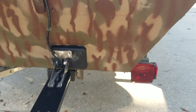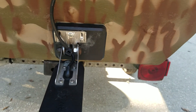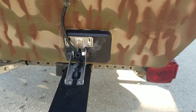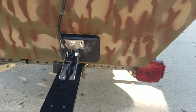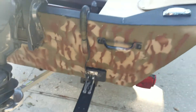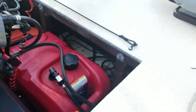Transducer on a transducer mount, so you don't have to drill a hole. That's a piece of marine grade PVC glued — or rather epoxied — on there. I've had it on there for about a month and it does fine. Vinyl wraps on the bunks so we don't have that rust issue.